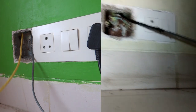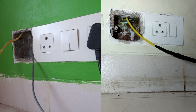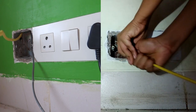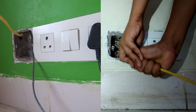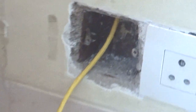All wiring is generally done on ceilings or flooring. Our wire has come to the other side — it's as simple as that. Now we are going to pull off all the remaining wire on the other side because we are going to crimp it and make it a LAN cable. You can also use this for phone line RJ11 connections in India, where connections are done with two wires, one pair. We are going to fold it in this manner and hang it till the crimping is done. On the other side we are going to make a knot and leave it like that.